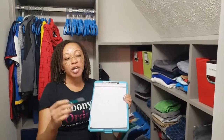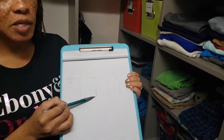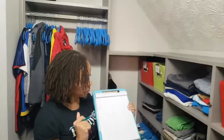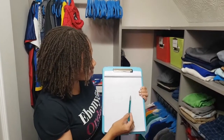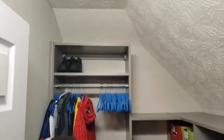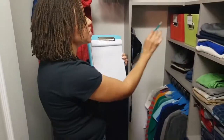So you want to make sure you have all the obstructions into account — if it's a light switch, if it's an outlet, things along those lines. These little marks on the sketch let me know that there is an angle on the ceiling. If you look over here, there's an angle right here, so you have to take that into account because you don't want to go too tall and then not have space for the product. I also like to do a sketch of the actual back wall as well, showing the angle. You can see it's straight there and then the angle slopes down. We're going to find our angle height, which will really help with figuring out the height of the system on this wall.